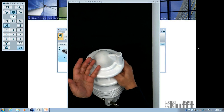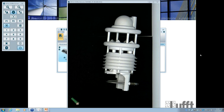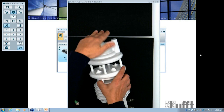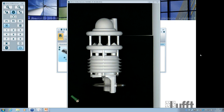And there is normally no influence from outside, only if you have some waving parts, like branches, which will act like a velocity. If the branch of a tree moves over the sensor like that, then of course the sensor will measure something like precipitation, and you will get a precipitation output. So normally, if you have nothing installed around the sensor, it will work without problem. It should not be near a tree or plants or anything like that.